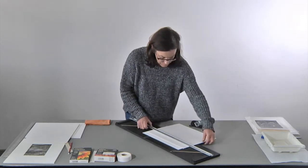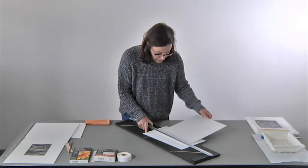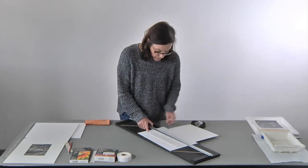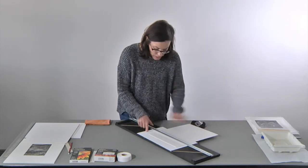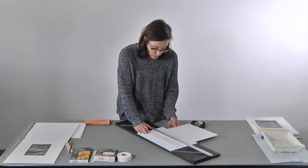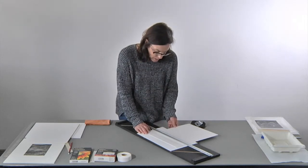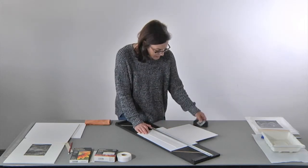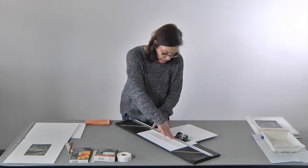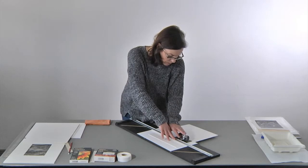I think all you gotta do is do a pass, and then a similar pass. If you need to, you can use a board that you're cutting into instead of something else. That's fine. If it helps you to talk through it, that's fine. You always want to cut into something. If you don't cut into anything, the blade will kind of tear through, and you'll have tear marks in the front of your board.